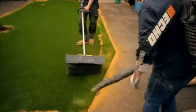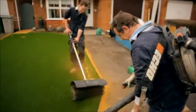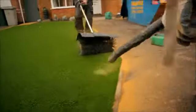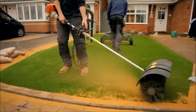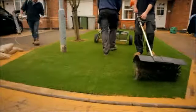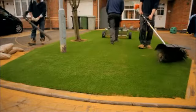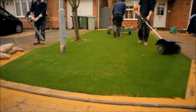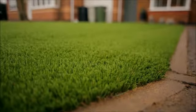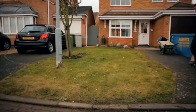If using a mechanical brush, brush the pile open around the perimeters dispersing the existing sand. Using a heavy duty blower, disperse any excessive sand the brush cannot remove. Once complete and using a sand hopper, apply approximately 5 coats of sand to the remaining area, followed up with a mechanical brush and blower. The installation is now complete — a perfect low maintenance lawn.